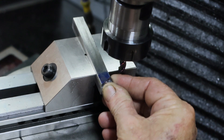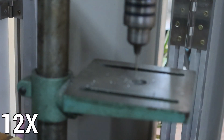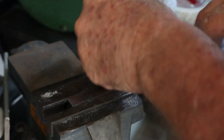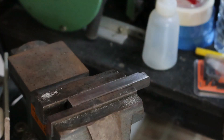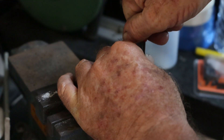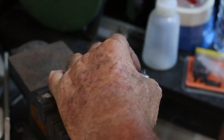Now I'll have to work out where to drill and tap that hole in there. I don't own the 2.05 millimeter drill, which is what I need for a 2.5 millimeter tap, so a 2 millimeter drill is going to have to do. Quite scary tapping threads with these tiny little taps. Well, it's a moment of truth - how well did I line that hole up? Not well by the looks of it. Don't drop that screw. It's cockeyed - I didn't get it in the right spot. Damn. That's a right bummer, that is.